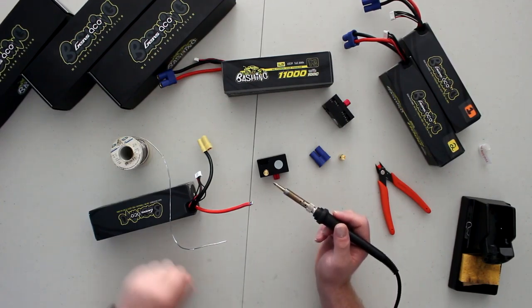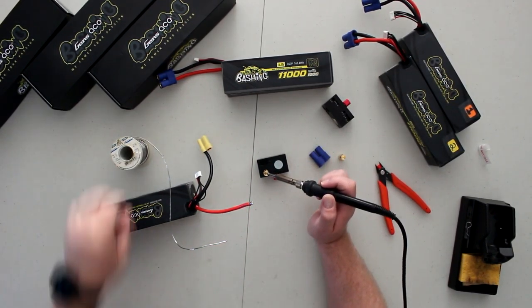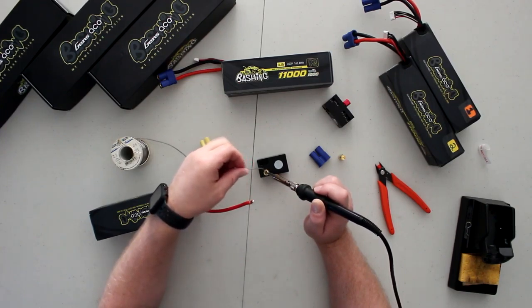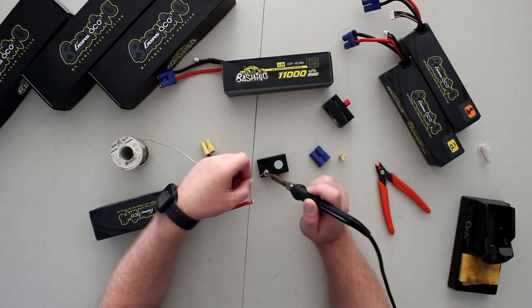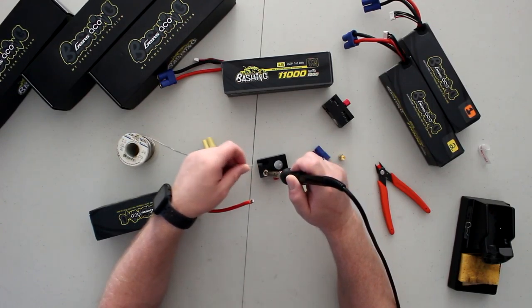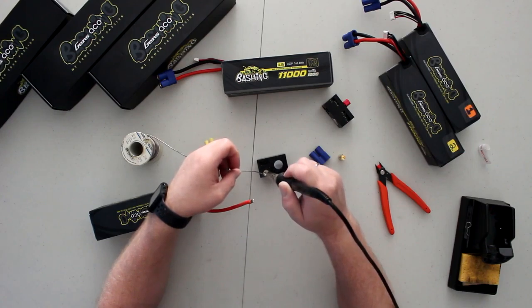I also have a video on how to solder a CC cap, and I'm being told I'm keeping my iron on it too long and going to burn the cap. If you know the Castle CC cap, the tabs are soldered to the board — if I heated it too long, those connections would unsolder from the board. I've been doing soldering for close to 40 years. That kind of shows you my age.